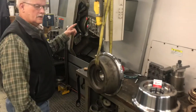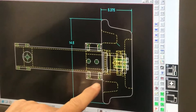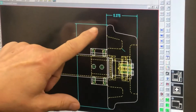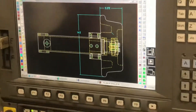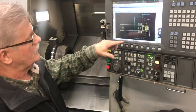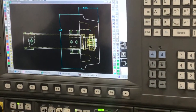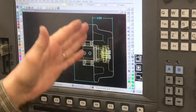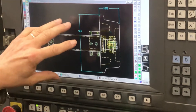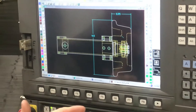We'll come look at the CAD view on here. It shows the wheel mounted to an axle with bearings inside, and a cap on the end with bolts that holds it onto the axle. You can see it finishes at 14½ inches in diameter and 5⅜ inches tall — 0.375 is 3/8 of an inch. All the other lines are basically radii and angles; they're not uniform straight cuts. The only straight cuts are the face on each end, the bore through there, and the bearing bores. We can use the actual shape of the part in CAD as our toolpath when we download the drawing into the machine.